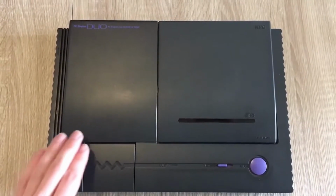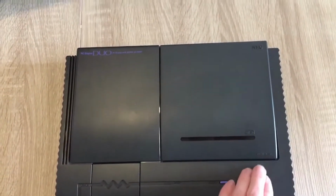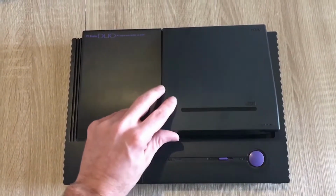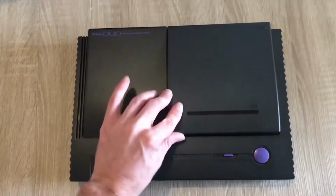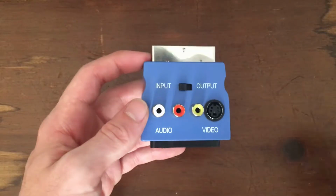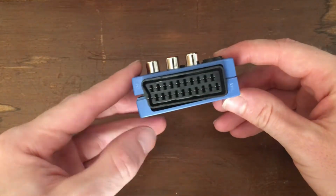However, the only console I have that is running SCART is my RGB modded PC Engine Duo, and since I don't have any converters aside from my OSSC, I have no way of playing it on my PVM, and that console doesn't even output composite now anyway. So I thought I'd use the parts from this converter to make an RGB SCART to RCA adapter.